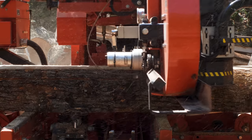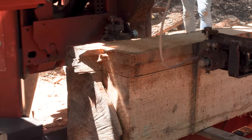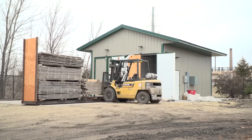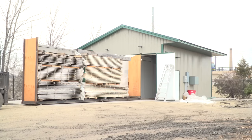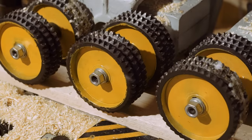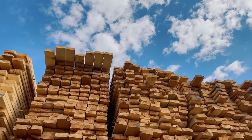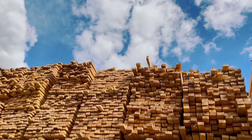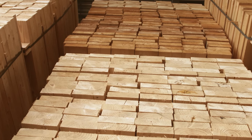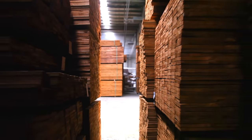We got to film a mobile sawmill to help cut some hardwood, which shows the general method of cutting a log into dimensional lumber. The next step is drying or seasoning the wood, which removes all the moisture in the freshly cut wood — the wood will shrink during this process. After drying, the wood is passed through planers, giving the lumber a smooth finish with round corners. These last two steps cause the 2x4 to not actually be 2 inches by 4 inches — shrinkage and extra milling removes about half an inch from each dimension, leaving the modern 2x4 as actually 1.5 inches by 3.5. From there, lumber is graded by quality and shipped to your local lumber yard.